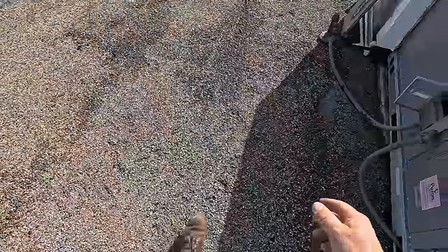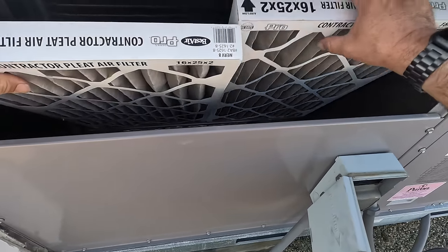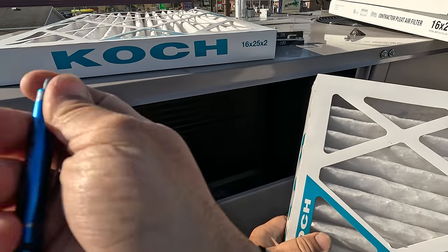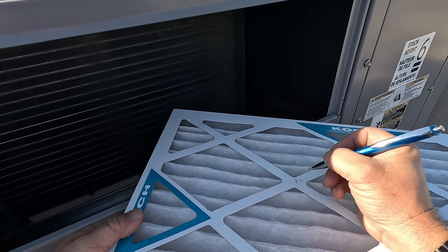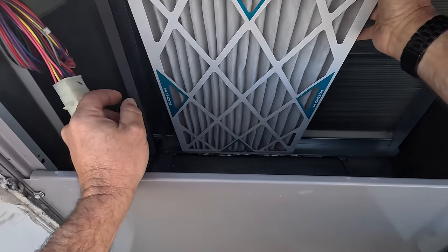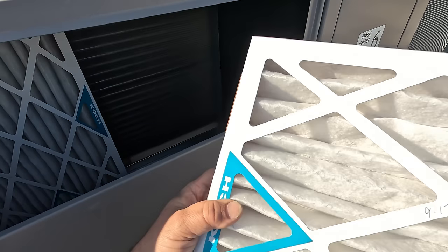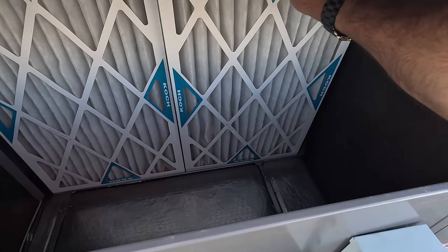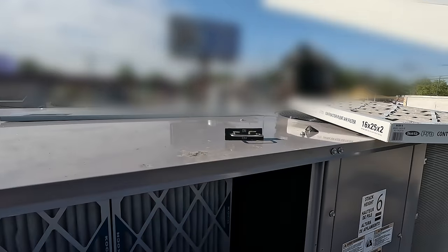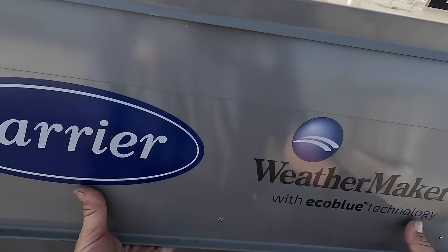This is pretty much a beginner's call, but I'm going to leave it in here because it appears that some of this stuff for the new guys seems to enjoy it. I'm always trying to show some of the most difficult stuff I find difficult so that other people would have it, but I sometimes think it doesn't do as good because there's more people doing this kind of stuff. The reason I'm leaving this on here is to show that we should do more than just replace the capacitor and leave — we should find out if there's any other issues that would have caused it, basically give them their money's worth while you're here. The filters in here were not completely plugged, however they have a pretty heavy dusting — and does he have us come out in the middle of winter? So why not just do it while you're here?